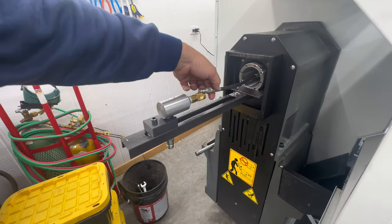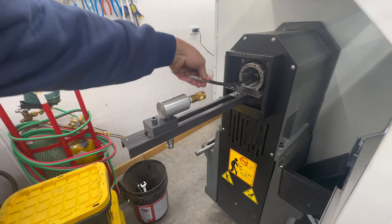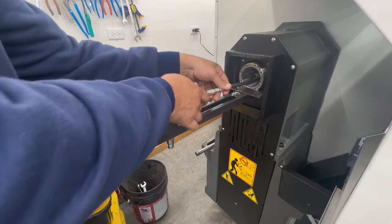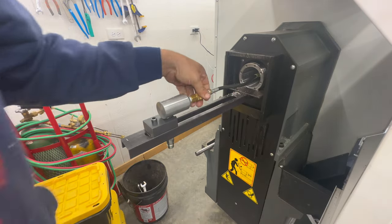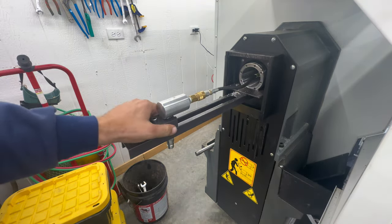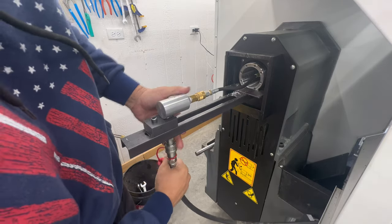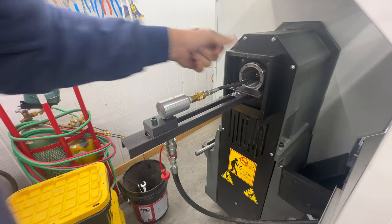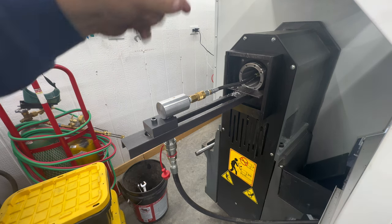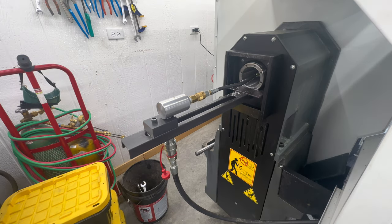I've got the barrel in the lathe. This is the hose we just screwed on — it quick-disconnects to the rotary union. This is adjustable in and out, and my oil pressure system quick-disconnects on the bottom. This way the barrel can spin and we'll have oil flowing through it. It's been basically leak-proof on everything I've done so far, so I'm pretty happy with the system.